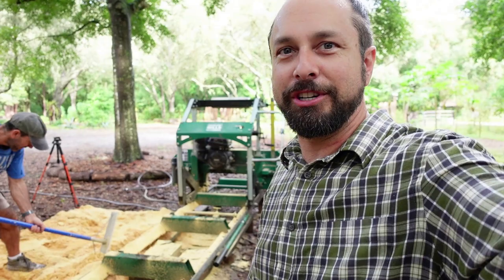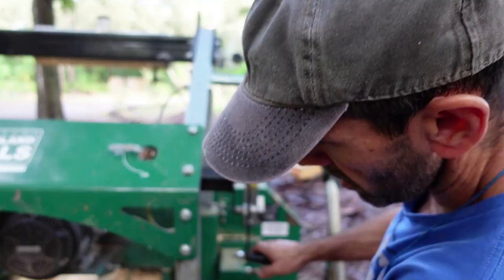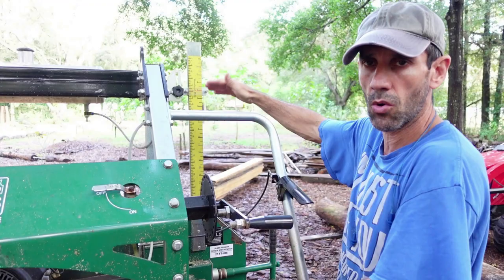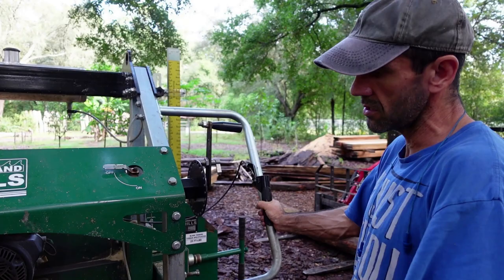I didn't even consider this, but we're working with pine, so I've got all the tar and pitch on my hands and all my camera equipment's going to get real sticky today. Before we do the next log, we're clearing off the tracks of the sawdust so the mill can push a little bit easier. This adjusts your height, right? Yep, this controls the height of the blade. You can tell right here — if you want to lower an inch, half inch, quarter, whatever, you just raise or lower the blade. Before you start going, you turn on the water so it lubricates the blade. And then there's the accelerator — you just press on this and just saw it up. That's how it works.